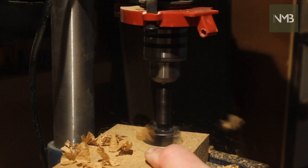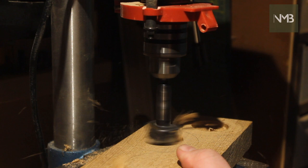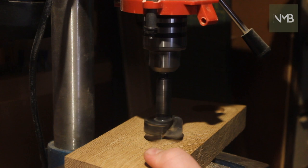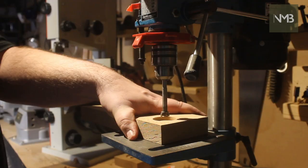My wood selection for these mushrooms is oak for the head and sycamore for the stem. Both are sourced from Scottish Wood, who are a local sawmill to me, and both timbers are native and sustainable. I'm looking for the clearest grain I can for the head, as I want to be able to sand it incredibly smooth to ensure there are no snags on the item being darned. Oak is great for this as you can get a really good finish.